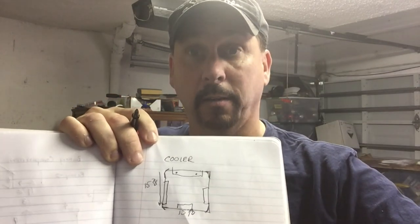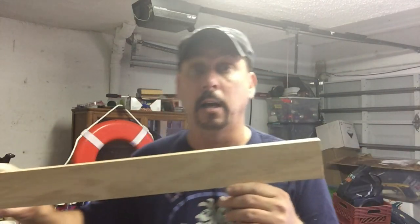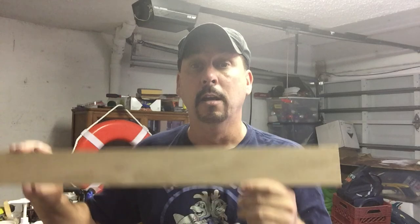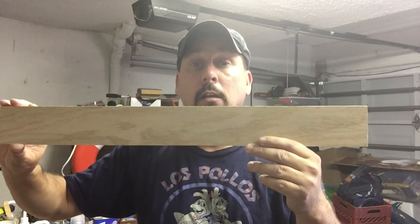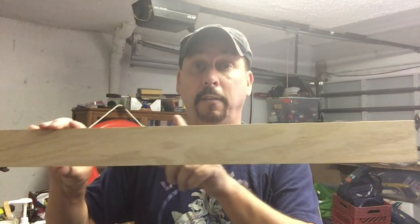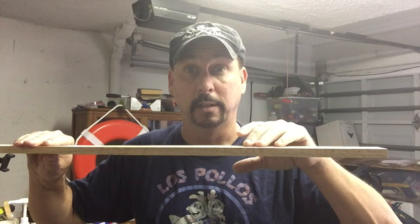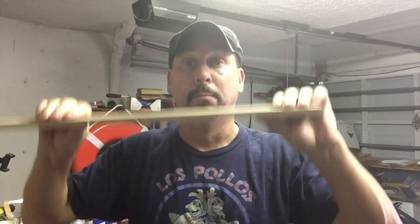As you set the lid down they sit in there, and that's what I'm going to be doing today. I got this at Home Depot — it was a nice find because usually I go to the lumberyard which is about an hour away. This is a perfect, nice exact replication of what was in there before. This is going to be a simple process: cut to 15 and 7/8, then I'm just going to epoxy it to give it some rough protection. This is oak, and if it rots there's just two screws — I can take it out, cut another piece, and put it back in.